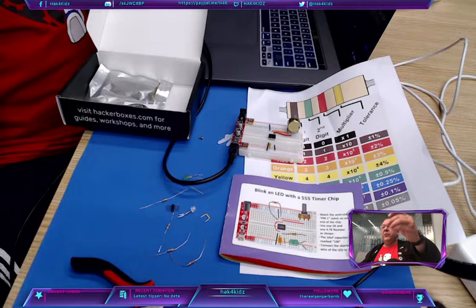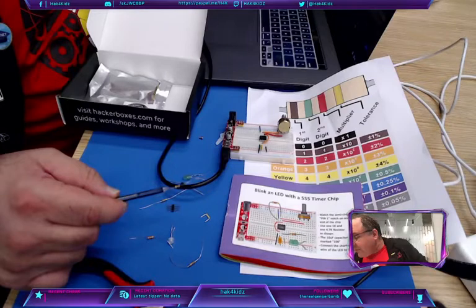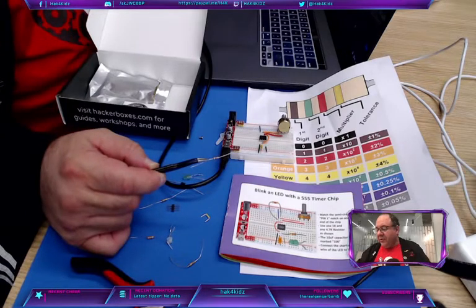Now, we're going to add the other components. So we've got a resistor that's red, brown, yellow. All right. Red, brown, yellow. Nope. That's purple. Oh, it's purple. It's not brown. In the book, purple looks almost like brown. I forgot to tell you. On your resistor, it looks very purple, but in the book, for some reason with the printing, it looks a little more brown.